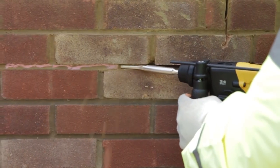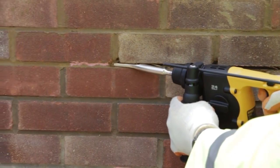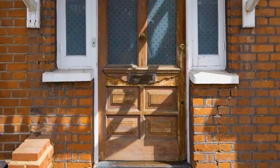It's only sand and lime so it's never going to hold up to that kind of treatment. What I would do is rake out this bit of pointing here, because it doesn't look great. You might as well try and match it in — that's the nice pointing there. If you can match it in, get yourself some mortar that's got lime in it. You can either get a hydraulic lime mortar, or you could probably get away with using a 6 sand, 1 cement, 1 hydrated lime mix. This is really a job for a brickie because you want it to look nice when it's done.